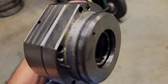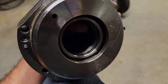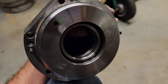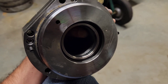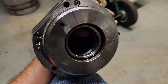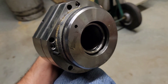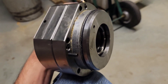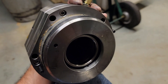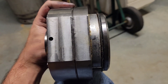This is the back side of your shaft seal assembly — this is what sits up inside the compressor. That seal right there is what goes out, so it'll start leaking by. Like I said, it's normal to have some bleed-by, but it shouldn't be enough to consistently fill that bottle in a short time frame — that's when you've got to fail it. We'll get those jacking bolts out, pull these fittings, install them on the new one, get the Molykote on, get the new O-rings on, and get it all stabbed in. The goal is to get this machine under pressure today for the pressure test.